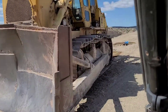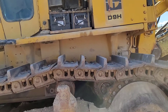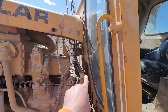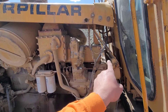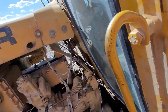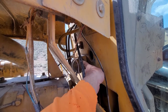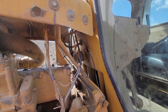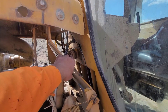There she is — she's a big girl. Let me get situated here and I'll show you where this goes. On this machine, this lever right here sticking up — that's your throttle control — and that goes to a series of linkages that end up coming out over here and go to your injection pump. By pushing that lever all the way forward it kicks this lever all the way forward and shuts fuel flow off to the engine, which kills the engine. The piece of the linkage that broke off is the one that goes from under the dash and connects right here, passing through this hole. I'm going to put it through from under the dash and get it bolted back up.